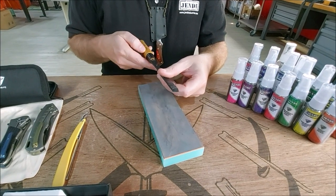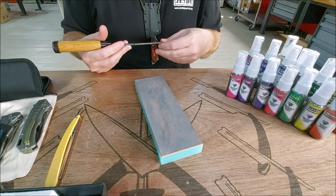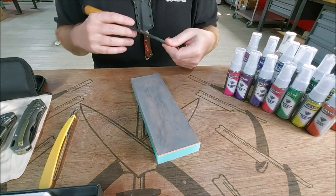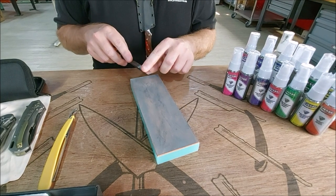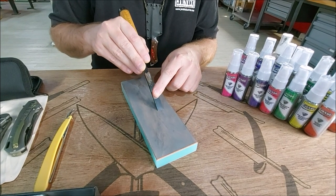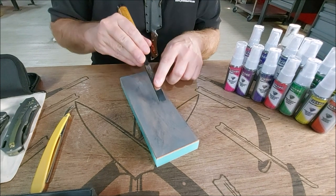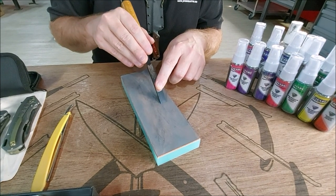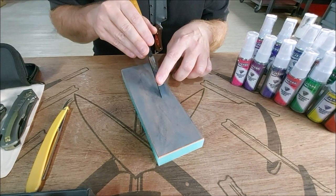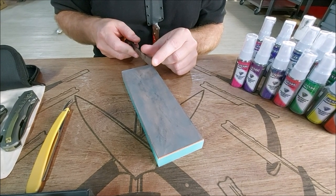Next up we have a chisel. Depending on what you're using to sharpen it — a lot of guys use mechanized sharpening and come off a leather belt, essentially 220 and a buff — or other guys will take it to stones and bring it up to the next level and finish with the strop. This has been done on more of a coarse version. Finding the angle, you don't want to be below the angle because you can feel it just sliding across the bevel doing nothing. You want to pull up until you get tactile feedback — go slow and slowly raise the angle until you feel it catch and feel a little scrape. That's right where you want to be. That's the edge — don't go past that.